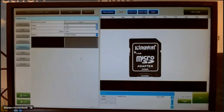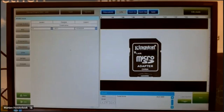In the parameters, you don't have to set up anything. You can set up the upper and lower limit, but you can also drag it here. That's the same. But I don't want to have the mix between the gray limits. And with the limits, you see that it calculates the amount of white pixels in this case. And this is the total that can be reached with this kind of camera.